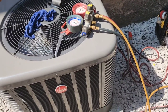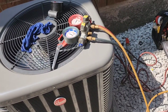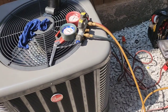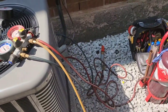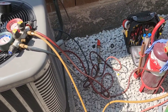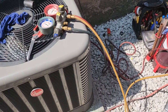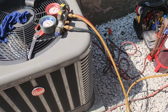I had a customer yesterday — I was doing a good repair in the shop and this guy comes to me. He says he had an air conditioning installed a year ago, it only worked for a day, and ever since he's been back there like three or four times to fix the leak. That tells me whoever installed that unit never pressure tested it.